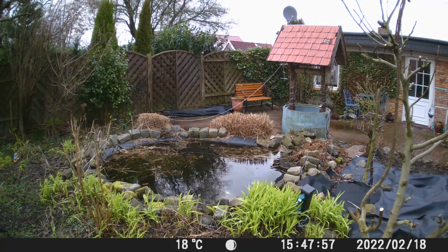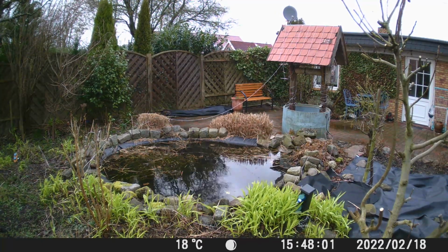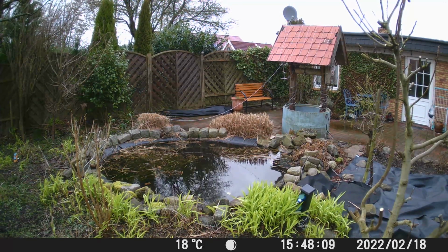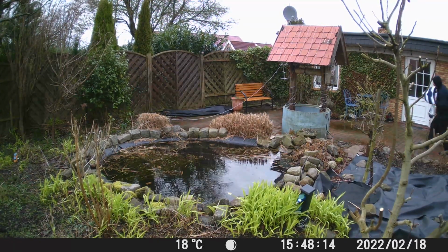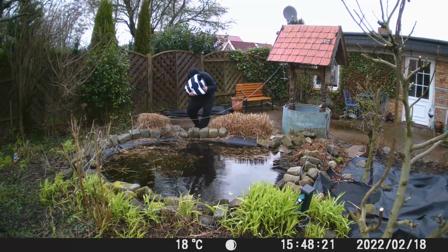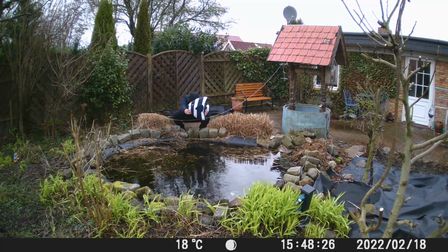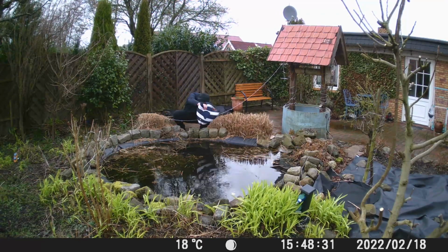Be sure we have read everything and set up everything before. So video length, interval, PIR sensitivity, and IR brightness parameters, and then you can make a good video or good shots. The PIR is strongly sensitive to ambient temperature. The greater the temperature difference between the environment and our subject, the farther the possible sensing distance. So you can choose it and go to sensitive more or less.